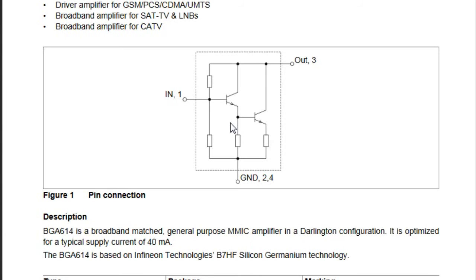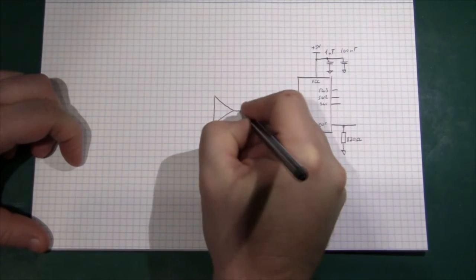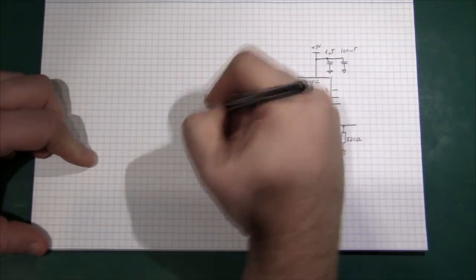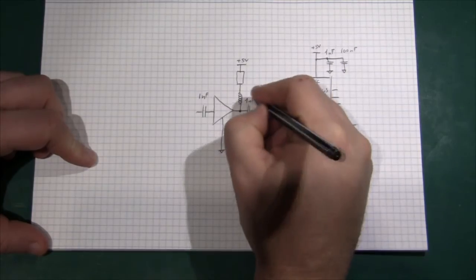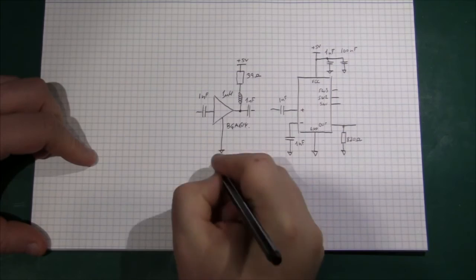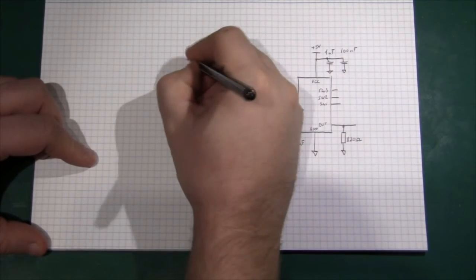I'm going to draw it directly into the circuit. I need 40 dB gain, so I need two stages. If you need more gain you can simply cascade them and just add one more stage. Because they have 50 ohm in and 50 ohm out, there's no loss or reflections — so just add more stages if you need more gain.